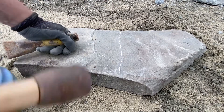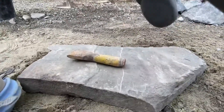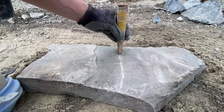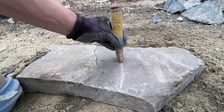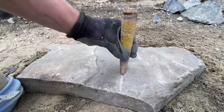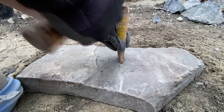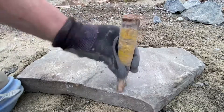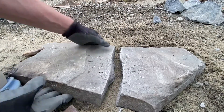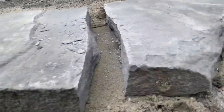In this case, I want to split the stone in half. Let's say I'm working on a stepping stone project and I want to make one really big piece into two so that it's all consistent sizing. I'm going to trace a line across the stone — you'll notice a rhythm to how I'm striking the chisel. I usually do a double tap, move it across the stone, double tap, and back and forth. That's suggesting to the stone where it should break. You'll find out very quickly that you can't force the stone to do something it doesn't want to.